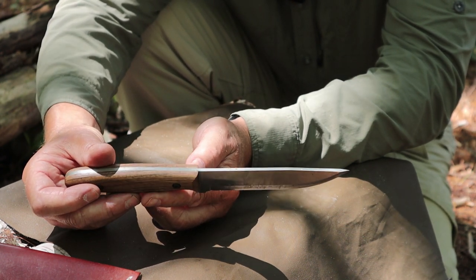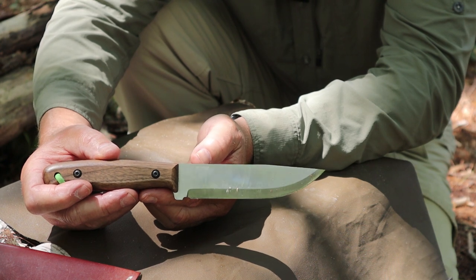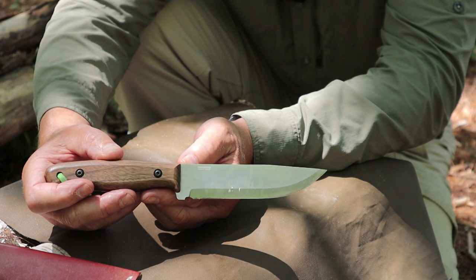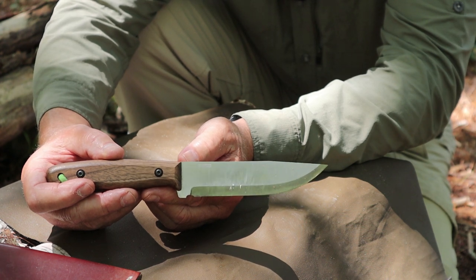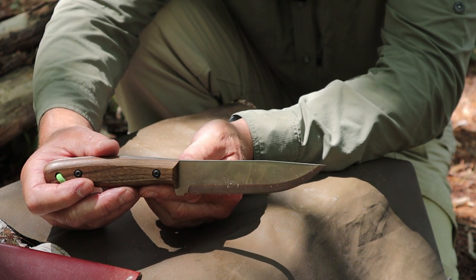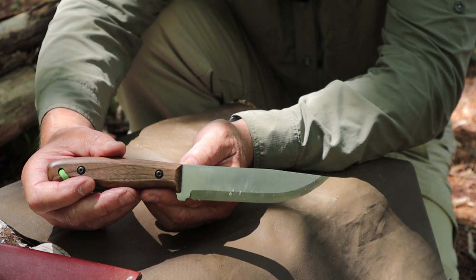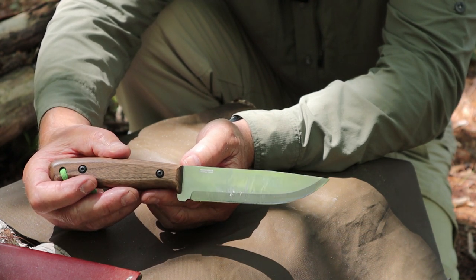The more I looked into 1066, what I discovered is it is actually quite similar in makeup to 5160 spring steel. I have a knife in 5160 that I would bet my life on — it has taken a real beating, kept a tremendous edge, and I've had it bend at quite an angle only to spring back fully into shape. Being a carbon steel, you do have to maintain it more than stainless to prevent rusting, but other than that there is absolutely no reason to turn your nose up at 1066 steel.